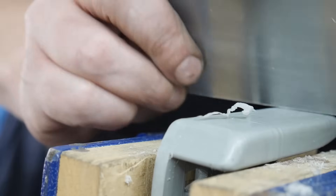I was watching a carpentry video recently — my father used to use these — and they're called card scrapers. Card scrapers are nothing more than spring steel or stainless steel, something fairly hard. You take this little edge and basically create a little burr that's folded over like that, and these things are razor sharp. They shave a 3D print — they don't sand a 3D print. So a couple of things happen.